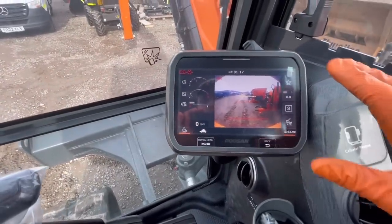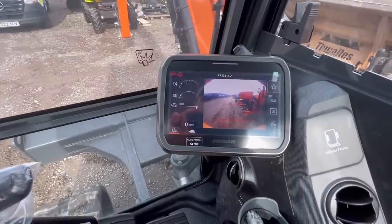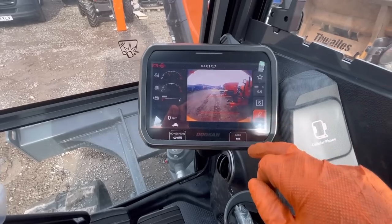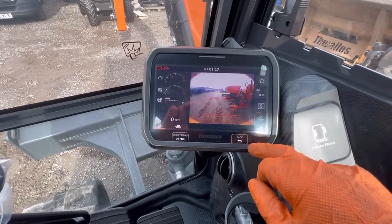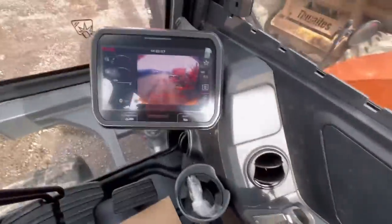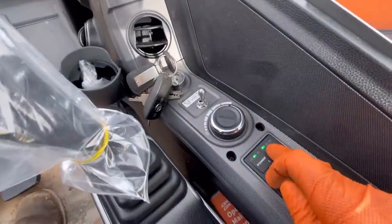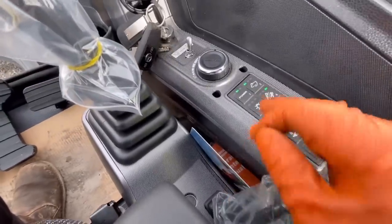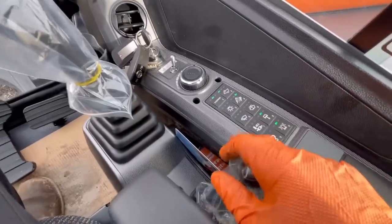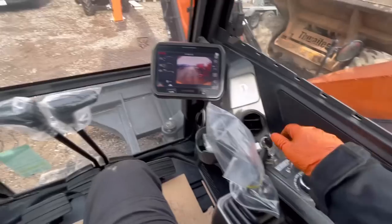Right, I'll grab my keys and fire it up. It's got the familiar dashboard layout, minus the AdBlue level obviously. At the moment you can see you're in dig mode — tap it and it alternates between hammer, two-way, and dig. You've also got a keypad here that does the same thing. There's also a keypad for two-speed, power, lights, wipers, backup alarm — turn that on and off — overload warning, and beacon.